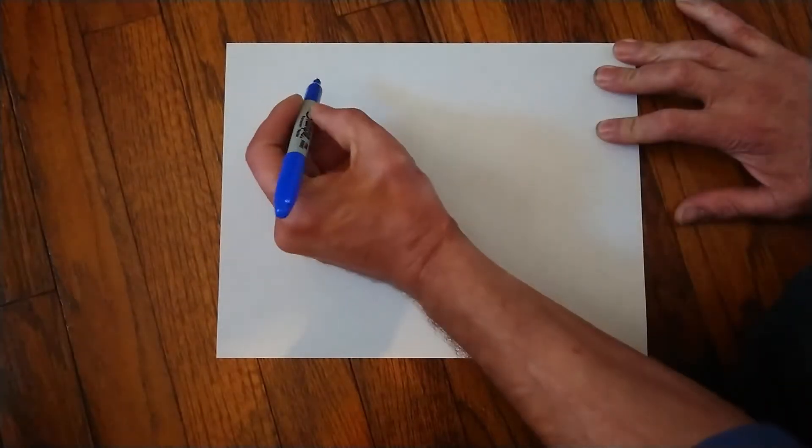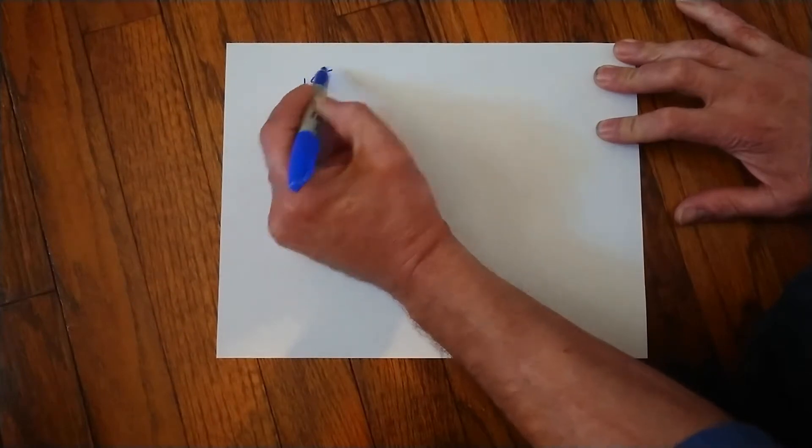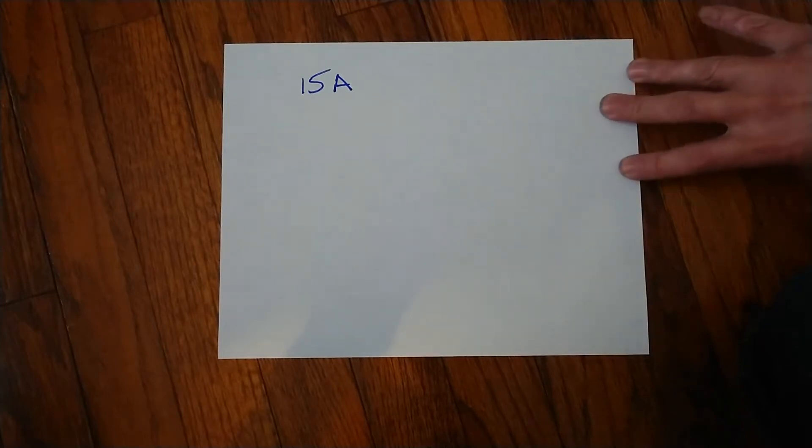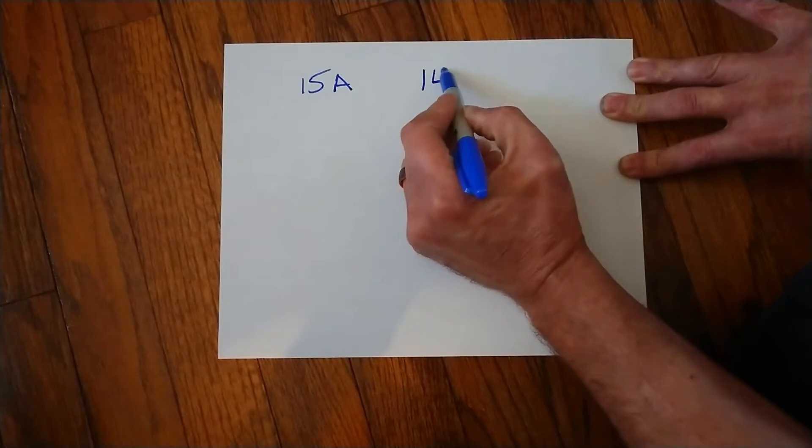Basic talk on the circuits within your house: you have a breaker box down in the basement usually, all the power runs through it and is divided amongst the breakers going to different places. The smallest breaker you would have in most cases would be 15 amps. Without even looking, we know that if we can keep the total power on that circuit well under 15 amps we're going to be fine. You never want to get near maximum power consumption, so within 80 percent, the number we're looking at is 1440 watts.